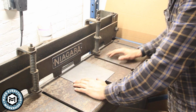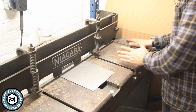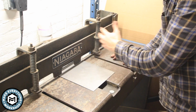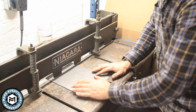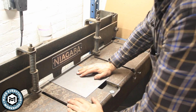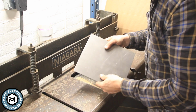Now what happens on these types of shears is a lot of people cut to the right side corner, so the blade tends to dull on the right side of these shears. Now if you're in a public shop or maybe your shear's a little dull, it can be frustrating to get a perfect cut in the middle of the shear. So now with this trick, I can put it on there, do my stomp, and my piece is cut perfect where those two registration marks were.